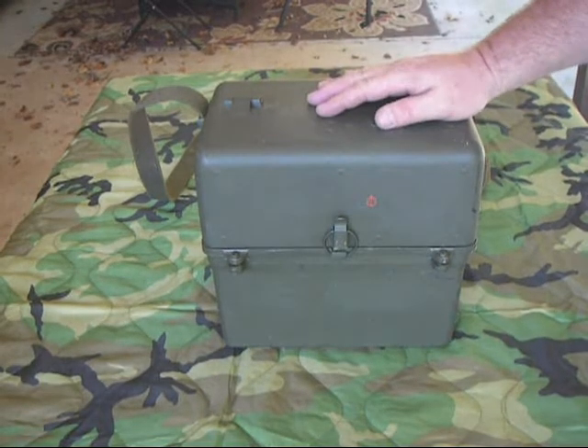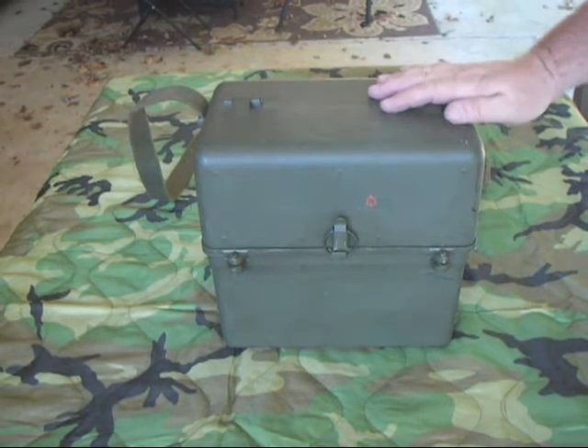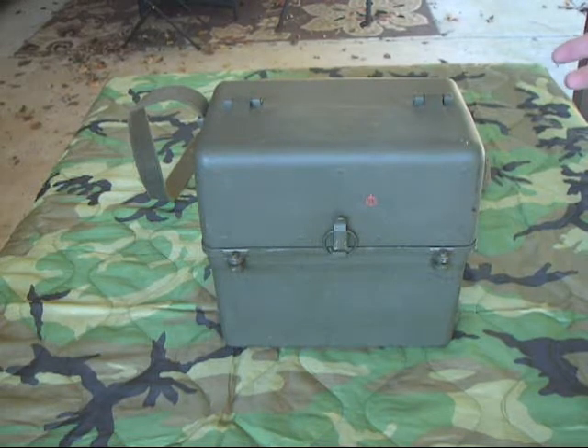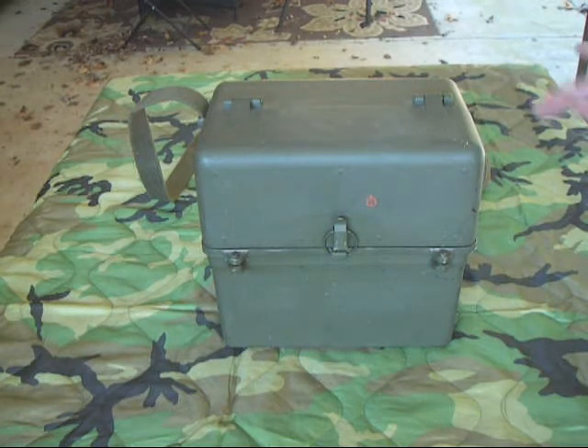This is a TP-9. These were developed in the early 40s during World War II to solve a problem they had with the range of field telephones over field wire. The range was finite — it wasn't exact science. You could go 10 miles or 12 miles, but there are deciding factors in the environment that cause problems. The solution was to put in what was called a repeater.